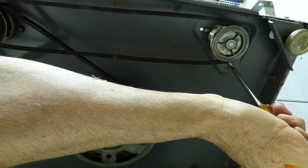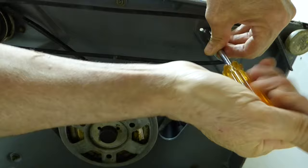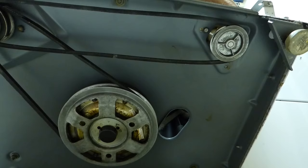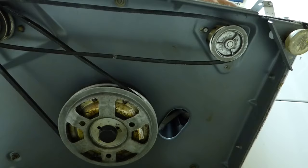I'll adjust it just a touch. To make this adjustment, we're going to loosen these three 5/16ths nuts with the nut driver. Just loosen them. And now you can see this will slide back and forth so we can make our adjustment. We want just a quarter inch in here when this starts moving. You can see it's right about there.